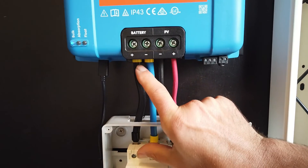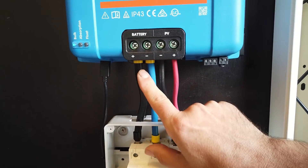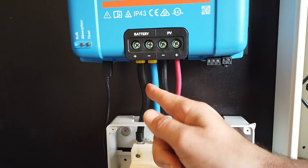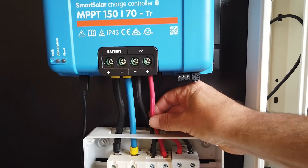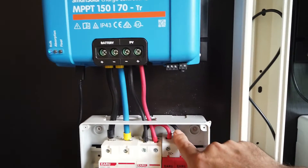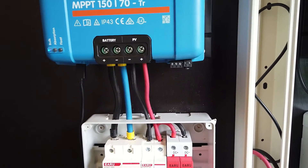Make sure you try to fit the cables before you put the connector on. Make sure they're long enough — if they're too short they won't fit, and if they're too long it will be very difficult to mount them. Solar cables are a bit smaller; they are 6 square millimeter and a bit easier to handle. It was also necessary, as you can see, to run cables here between the breaker and the surge protection device.